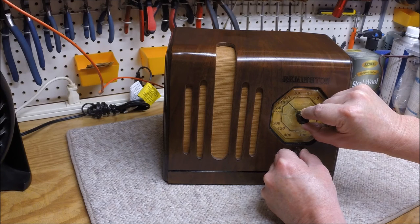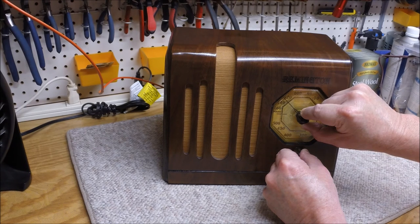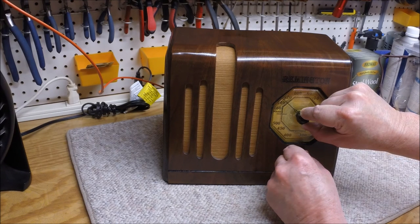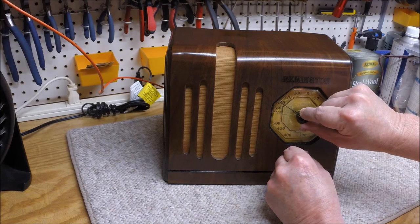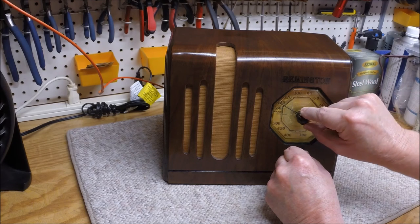There's a local broadcast station here that really just creates some selectivity issues for the tuner, making it hard to capture some additional channels above 1100 on the band. I think the radio is really performing as it should for this type of design — a TRF receiver.